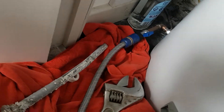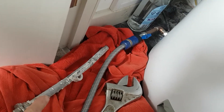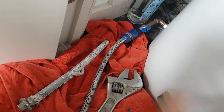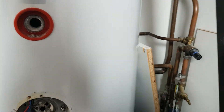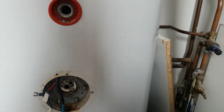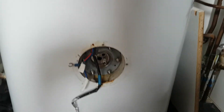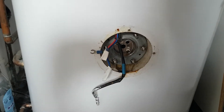The sacrificial magnesium anode is here - it's still intact, and that's been changed every year also to protect the stainless steel tank. You need one of these to stop the galvanic action attacking the stainless steel. Whoever installed this shouldn't really have used any copper pipes or fittings close to the tank. Some pundits say you're supposed to have stainless steel fittings right up until the tank, otherwise you'll get some corrosion of the tank.